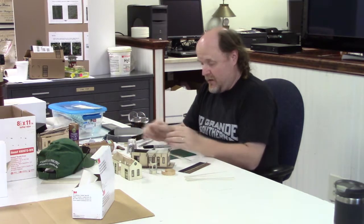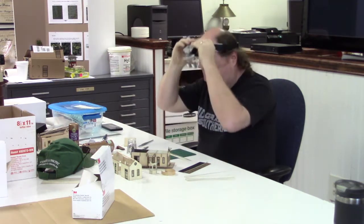You let that set, take the next row, put some glue down, chart tape, then that end goes down again over the clear edge from the bottom row. Line that up and you get that all the way to the top. Then you come back and peel up the edge of that chart tape, and it leaves you an entire roof of individual hand-laid wooden shingles. It's not that much more time consuming than doing this, and it is a much better look if you're doing a shake shingle roof, of course.